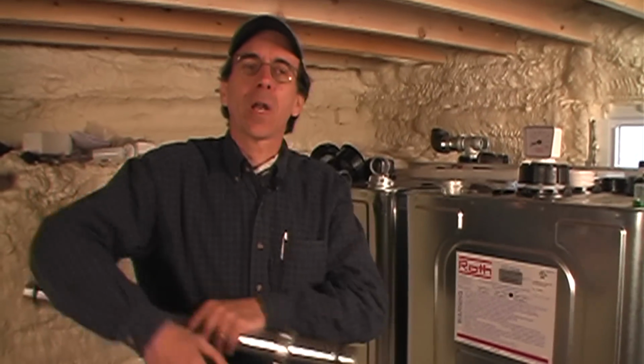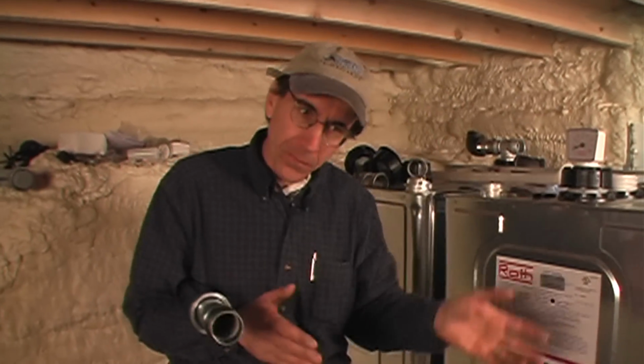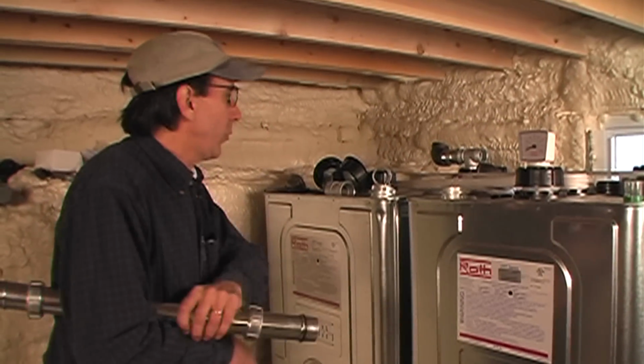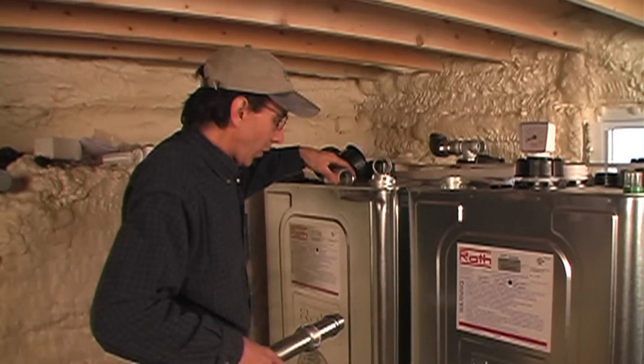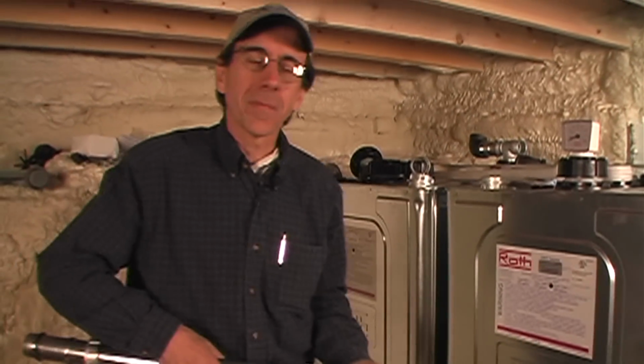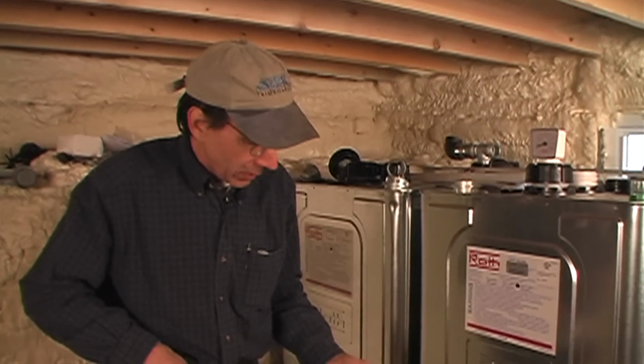Now, what I just described, where we have one tank cascade over into a second tank, those tanks are in series. We fill the first tank, then we fill the second tank. What these guys do is they put them in parallel. Okay? So when we do things in parallel, we fill them together and we vent them together. And I'll show you how we do it.